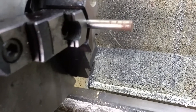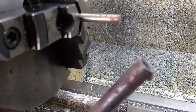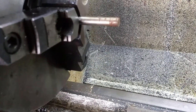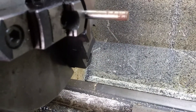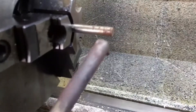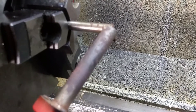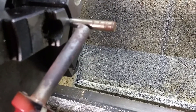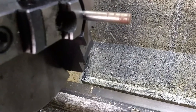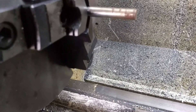I'd like to have a little shoulder on it, so whenever I stick it in this hole it has a shoulder to bottom out on. I'll show you that when I get finished machining. I'm not going to show the full machining — basically I'm going to machine this 5/16ths rod down to quarter inch, part it off leaving a little shoulder, and then cut a slit in it with a slitting saw, which I've got set up right here.